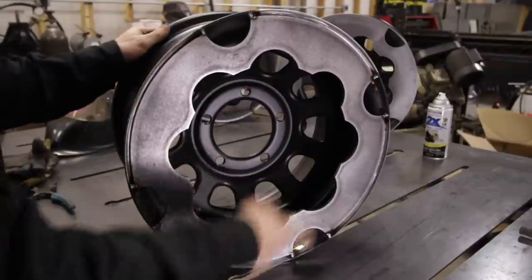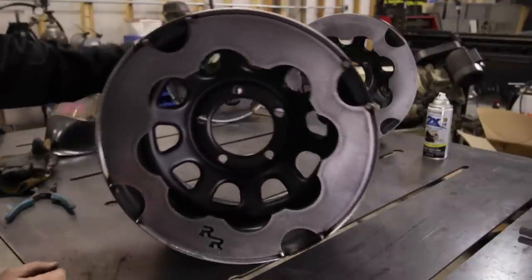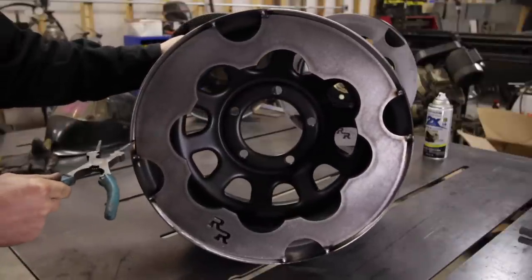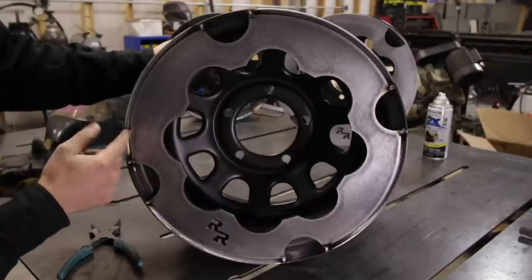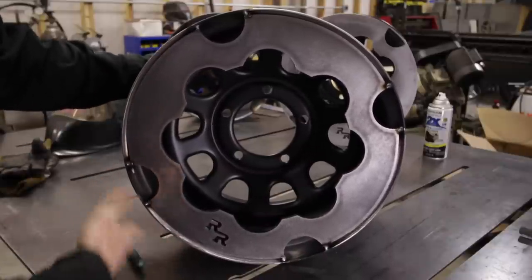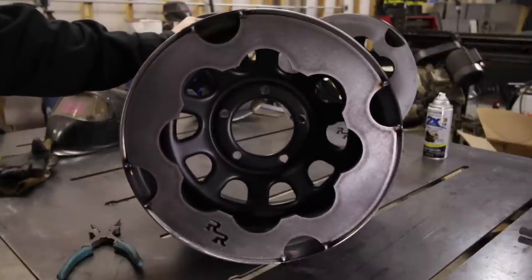Once you have the rock ring tacked in place and alignment looks good, the next thing to do is weld these big beads in and fill them up. These take quite a while and you want to try to fill as high as you can, because those gaps go in pretty deep. If you don't fill enough on the first pass, you're probably going to have a bunch of holes left that you'll have to go back and sand if you care about the way they look. Or if you can weld well enough, you can just lay a nice bead and you don't necessarily have to sand it at all.